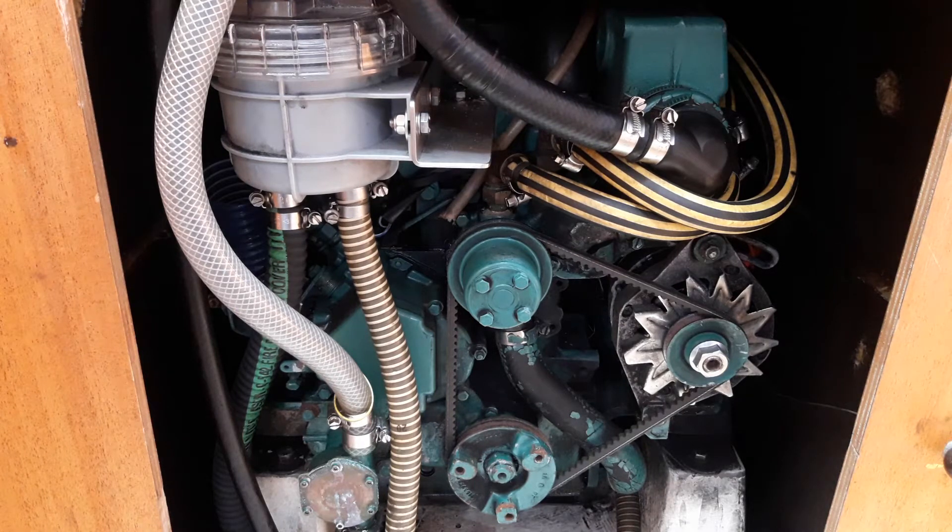If it doesn't cure the problem, or if it's run dry for some time, the water pump is just here. And if the rubber impeller is burnt out, just remove the six screws holding the faceplate on, pull out the remains of the old impeller, find the new one in the engine spares kit, pop it in and replace the faceplate. For seawater, that's it — it comes through this box, to the pump, into the engine and out of the exhaust.